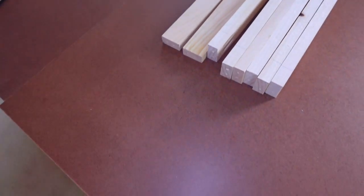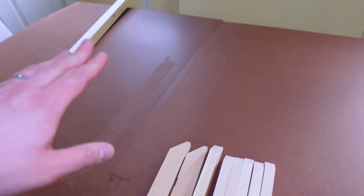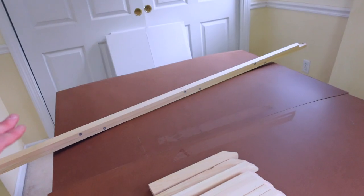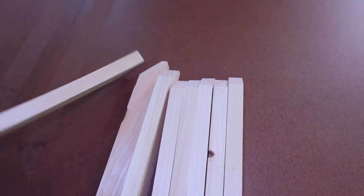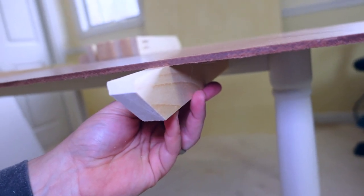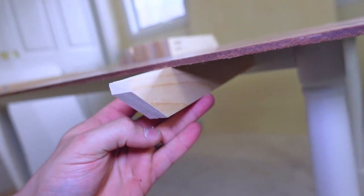Not quite done yet, but I did a bunch of cutting. I had to make a bunch of these pieces, so you'll see that there's a taper here. By the way, this is the piece that she kind of used to have before — you can see it's very wobbly, it's not secure to anything, and it also has this bend, this bow in the entire thing. So that's not great, but it gives me a nice work surface here to show you guys what's going on. I also removed the long pieces that I had already installed before because I wanted to add this taper to the edge — these pieces are going to go like this, and I didn't want a square edge, so I just chopped off a little 45-degree angle there on all those pieces.